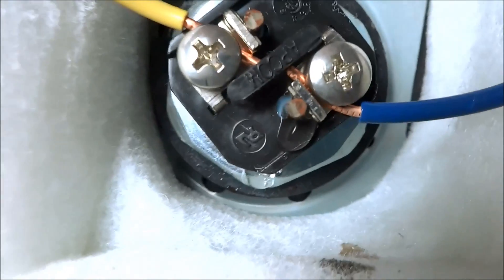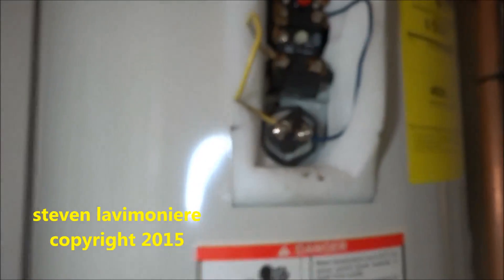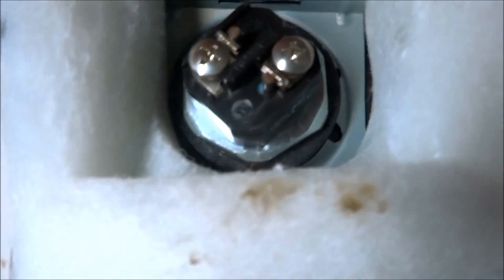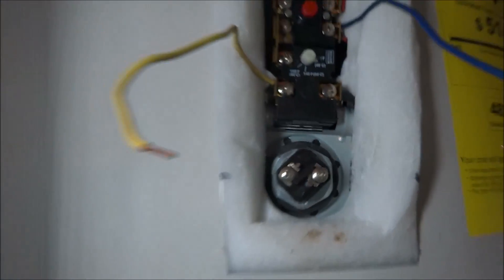The insurance company wants it done right away. That probe was leaking right there — I'll send it out tonight. The top element was leaking right from the plastic, dripping right off the plastic. So I'm draining this tank out; I've got to change it. I'm okay with the bottom one, just need to swap the top.